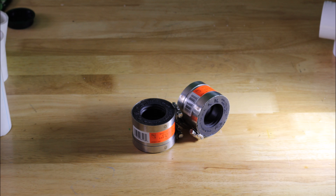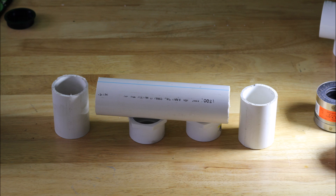These two fittings are called MJ couplings. These are 2-inch plastic by inch-and-a-half copper. They will make the end of the outer chamber. Next, we need the 2-inch pipe which will make the outer chamber. This is Schedule 40 PVC pipe found in every hardware store in America and Canada.